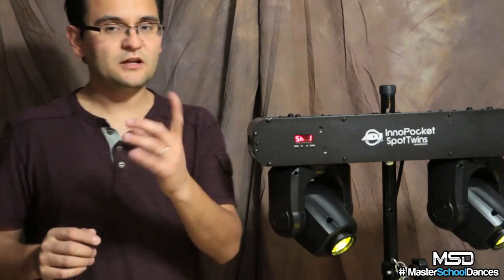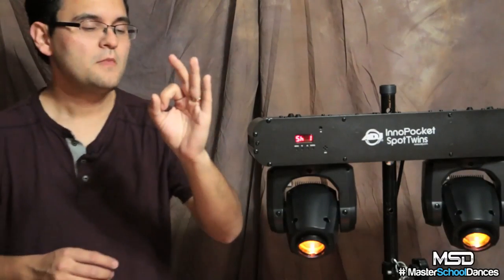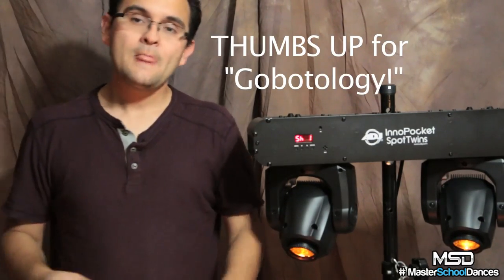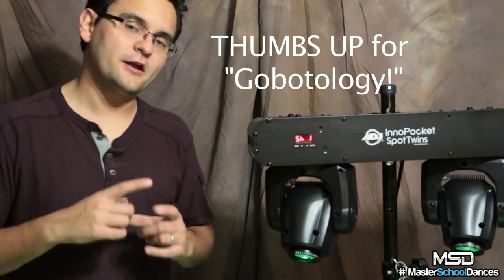Let's look at that 12-watt LED rating a little bit closer. We've got to look at more than just the source — the LED — and more than just the output. You also have to look at the surface area. Let's use a 50-watt InnoSpot LED — the original, the start of the whole series. The gobo is about this size. The light goes through it, the lenses focus it, and then it goes. But what if we made the surface area of that gobo bigger? If we take that same 50-watt LED and make the InnoSpot much bigger, suddenly that 50-watt LED has to cover an A-size gobo. You're going to notice it's not going to be as bright as the smaller gobo, even if the pattern's exactly the same. The reason is surface area.